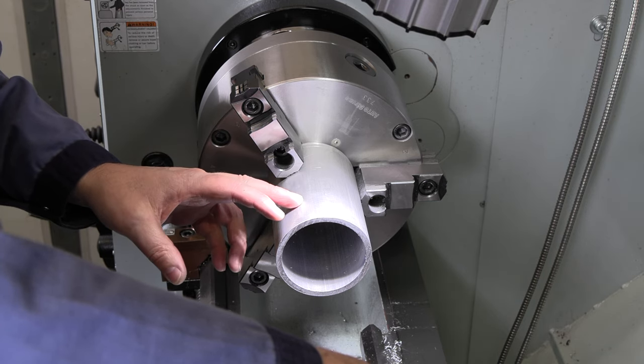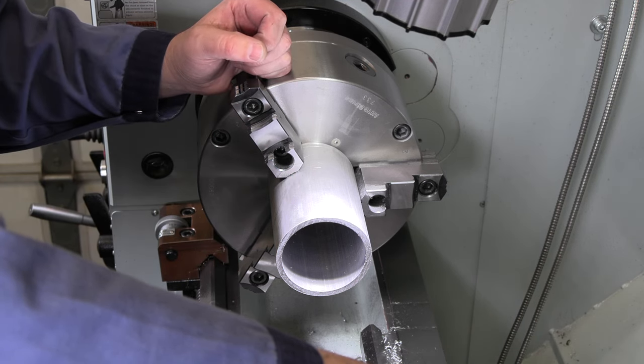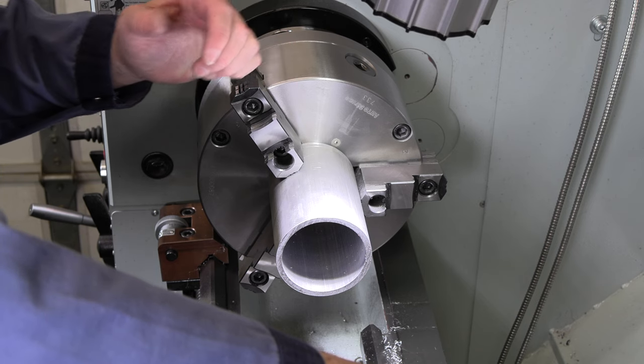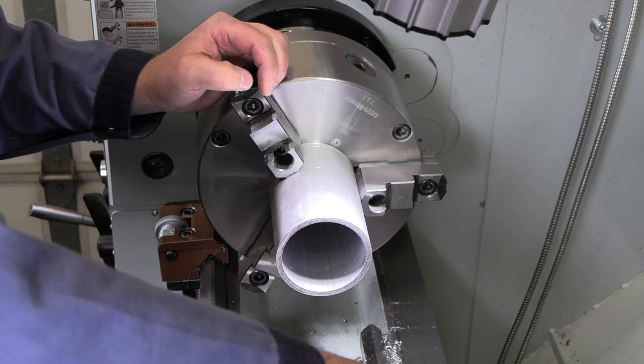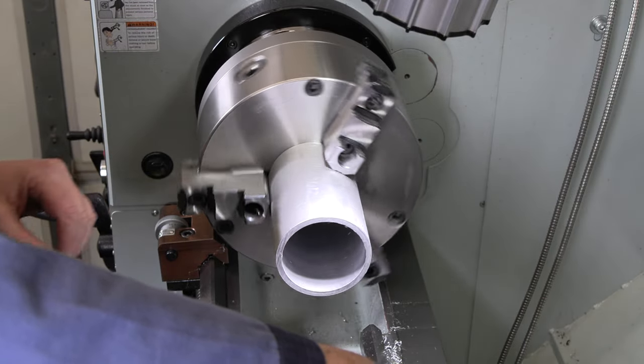So we wanna get the bolt circle accurate, and then that hole through the flywheel, that's gonna lock onto that 3/16 shaft. So we're gonna ream that. We want that to be a pretty nice fit. Most everything else on here, you've got pretty good flexibility in the dimensions. I think we're gonna be in good shape with just clean this up, and we'll see where we end up for size.